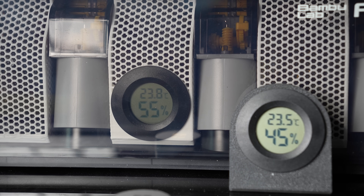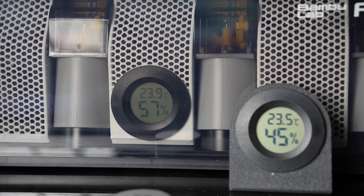After about five minutes or so, the temperature gauge I have in the unit is starting to climb, which seems fine because it is at the bottom of the AMS unit. What seems odd is that the humidity is starting to rise. After letting it go for a while, I realized that the desiccant in those containers had been in there for a while and needs to be dried out. So as the AMS heats up, it's starting to release the moisture trapped in it. I pulled the containers out to go dry the desiccant and left the machine running.